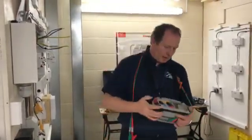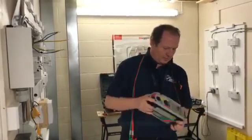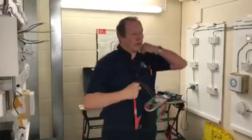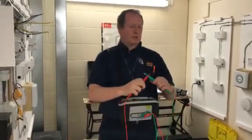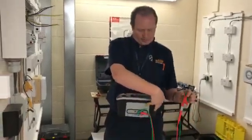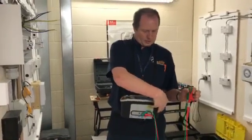You're going to have to set the metre up onto the ohm scale, which is the orange setting. We're going to be using crocodile clips with the leads. The first thing we need to do is null the leads, to get rid of the resistance within the leads themselves. We're going to join them together with a crocodile clip and null the leads.